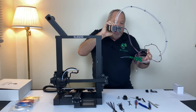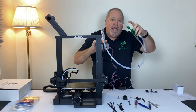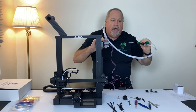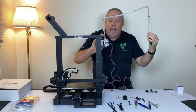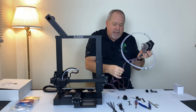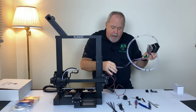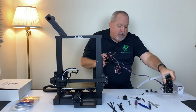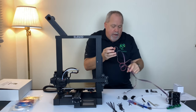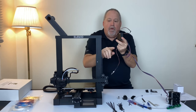We've unwrapped the 3D Chameleon and you'll see we wind up with a pretty long chain. Starting from the green end, we have a small 4-inch (100mm) length of PTFE tube, then the Y-adapter, then a meter of tube connecting back to the 3D Chameleon. Coming off the 3D Chameleon we have two wires — on some older machines these are separate wires; on newer ones it's a single ribbon cable — and that takes us back to the electronics, which are in their own printed housing with two couplers for attaching to your frame. And lastly we have the actual switch that triggers the unit.